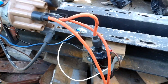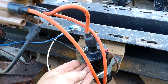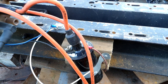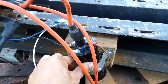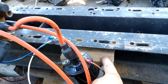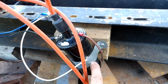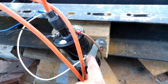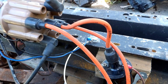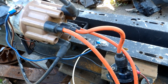Early on, I didn't have this ground wire going from the coil to the frame. I was getting zapped because the outside of the coil itself needs to be grounded. It's attached to a wood block, so it wasn't actually grounded. Now, this strap here — I've scratched the paint off and the wire grounds the outer case of the coil.